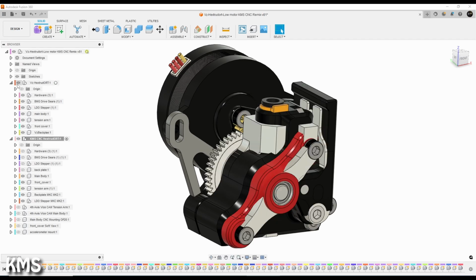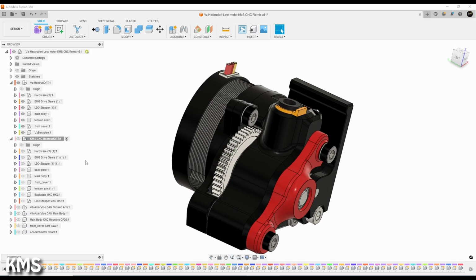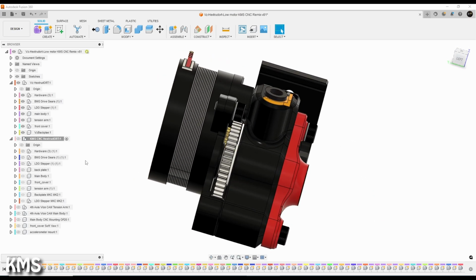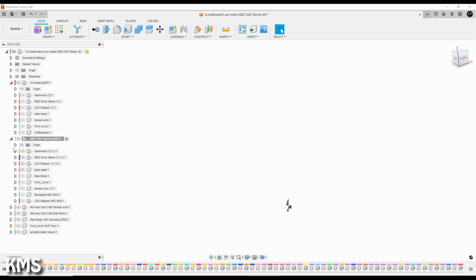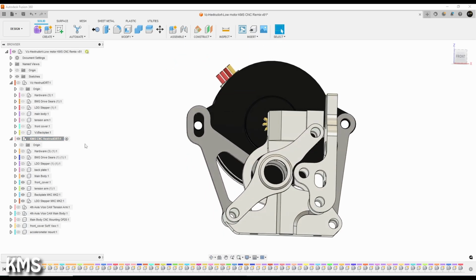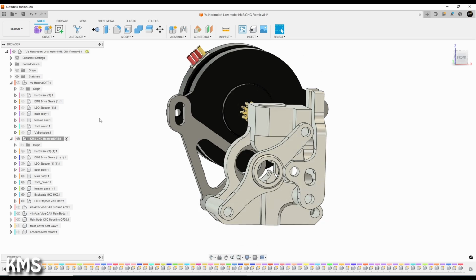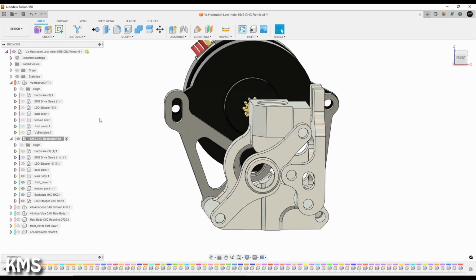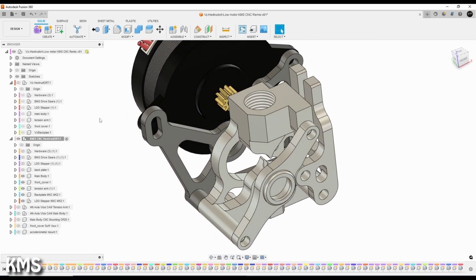You can get the model of the 3D printed version, so there you can take all your critical dimensions, the hole locations, the bearing locations and all this, and then strip it down to what you need or what you think you need for machining. So between the 3D printed version that I had here and having a look at the CNCed version on GitHub, I was able to get this done quite fast, I think one evening, and the model basically was done.